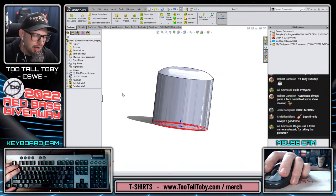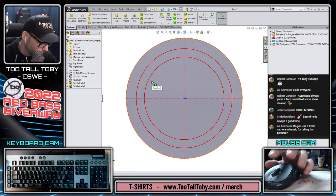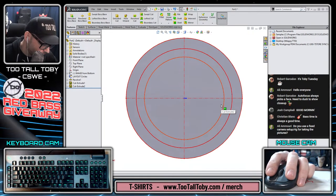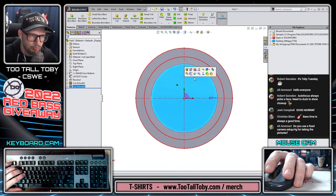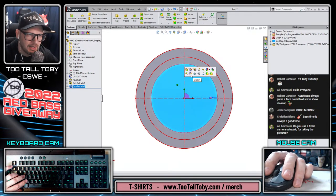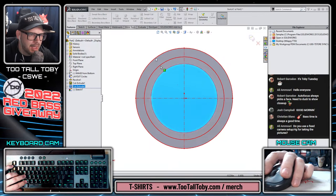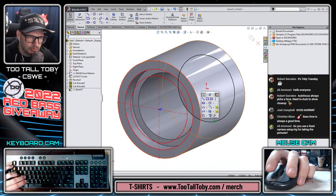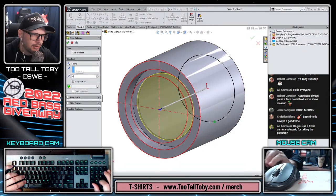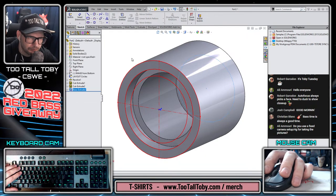We're good. All right, now we're ready to start working on the plastic insert for this thing. So the plastic insert for this thing, again, doesn't need to be hyper defined. We could probably just get this thing close to what it's supposed to look like, and it'll get the point across if anybody sees it or wants to do an explode view or anything. So select this face, begin a sketch, orient the view. I'm going to do a convert entities on this face, and then I'm going to extrude that out to a depth of, say, 30 thou for the wall thickness and not merge the results.